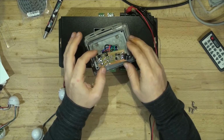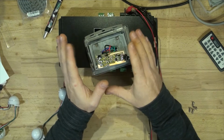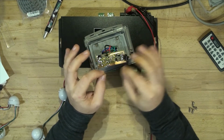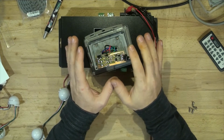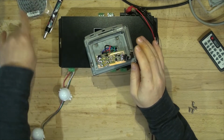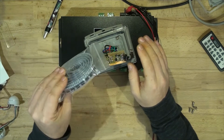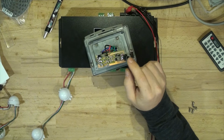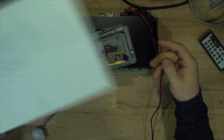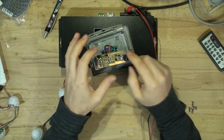So what I'm going to do is first solder it with wire joints, just to join the parts and see how it performs. I've already chosen 68 microhenry coils here, so I've got quite a few of those. I've got the controller, so my plan is, I've done a little thing here which is quite messy, but it's just to help me while I'm designing a prototype.